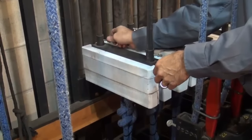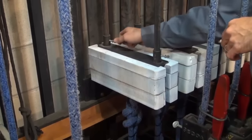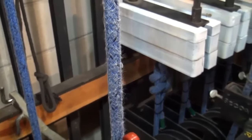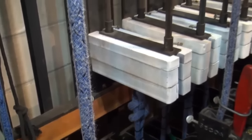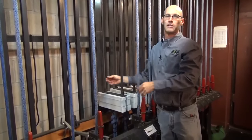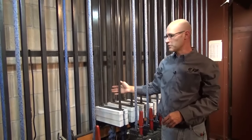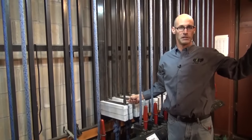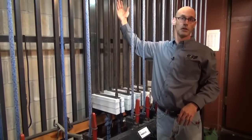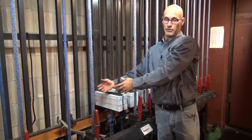In a runaway where the arbor crashes, it can deform, spread the rods open, and drop the weights. Spreader plates distributed correctly prevent this. The worst case is an out-of-balance condition where the batten is heavy, the arbor light, and it runs away upward and crashes. Without spreader plates and locked collars, counterweights can cascade to the floor — which is obviously a lethal condition.